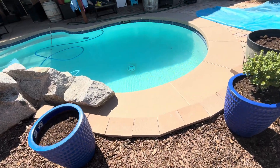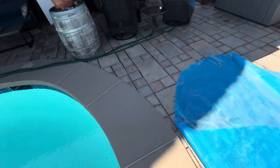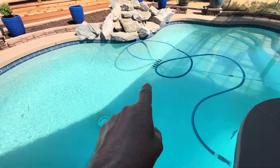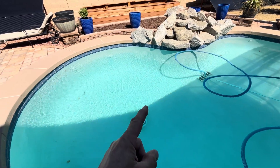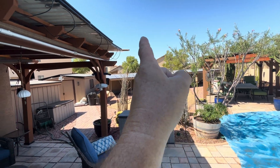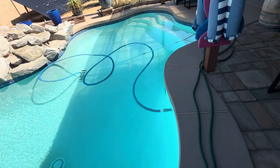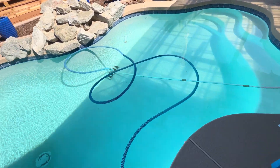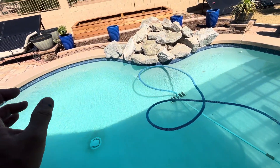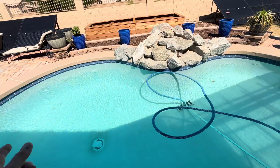I just wanted to tell that subscriber how I handle the pool cover — with it on, I don't need to really use a heater. You can see that over half my pool is in the shade right now, and the sun sets over here, so I can only get a little heat from that one area. During the day I'll run the pump at around 2,000 to 2,400 RPMs to collect that heat and cycle it through the pool.